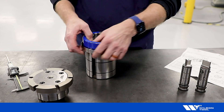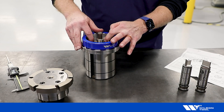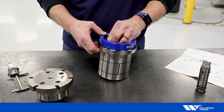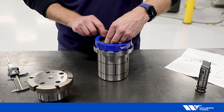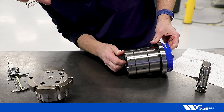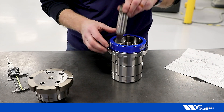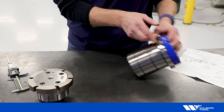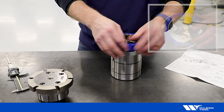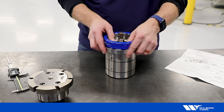There's usually a little fiddling with the stripper plate to get the punch to drop all the way in. After dropping each punch in, I make sure the skid plate still turns freely and doesn't rub on anything. I do the square — I just needed to twist the skid plate a little bit — and then the rectangle. The skid plate turns around nice and freely, so nothing is sitting at the wrong height.